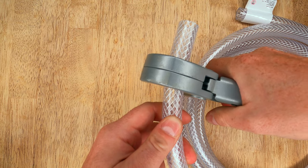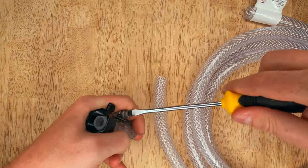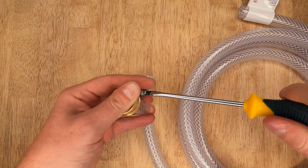The first step is to cut two 2.5-inch lengths of hose. Then you clamp them down over the adapters, and finally the hose ends. You need one female and one male. Hand-tighten only.